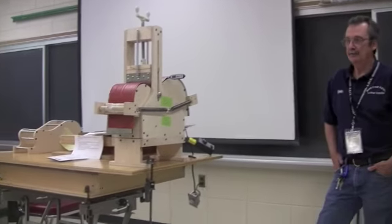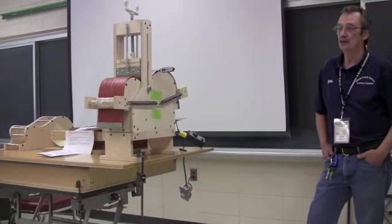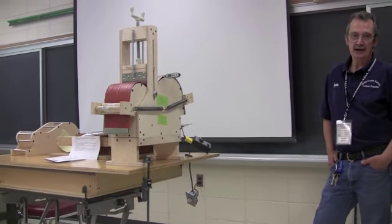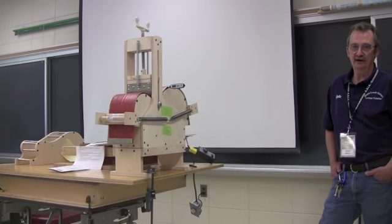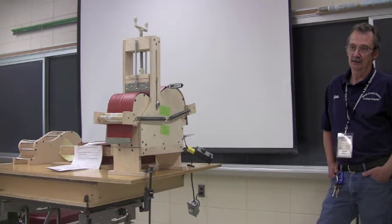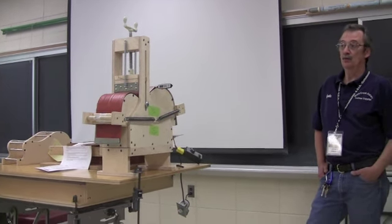Most problems with bending the first time are people will go too fast or they go too slow. If you let the wood dry out, at that point, the wood cells become case hardened, and it's like untying a pretzel.